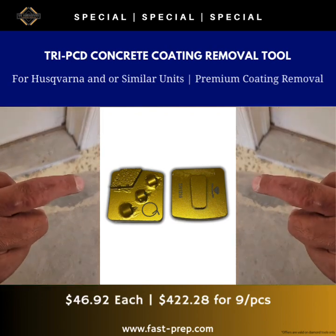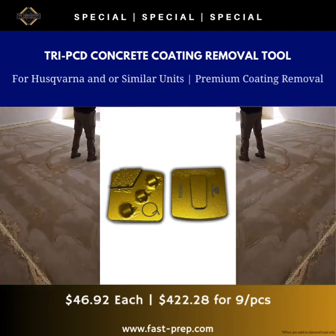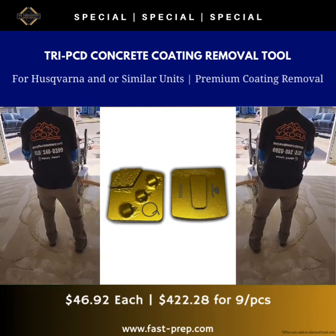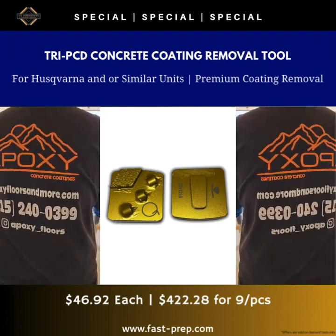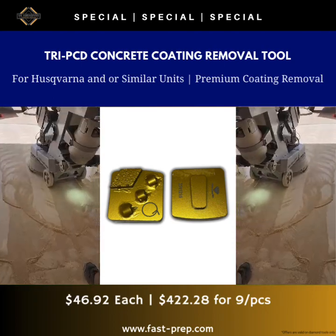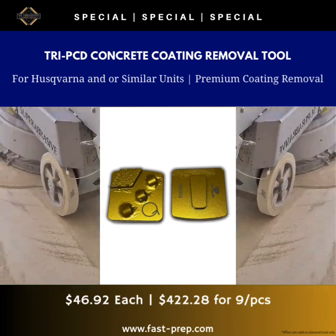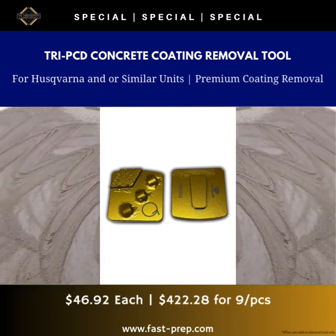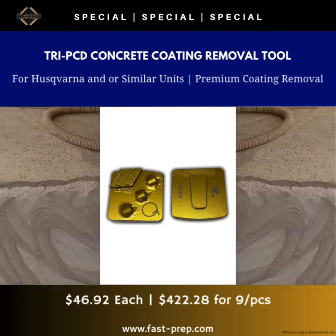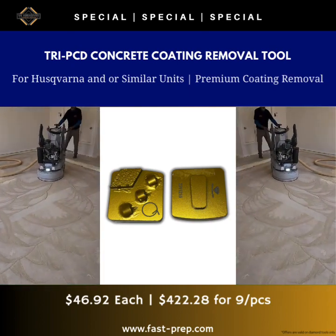You're going to be able to do a heavy removal of protective coatings very fast — from glues, mastic, underlayments, and polyaspartics. You can remove anything that's sticky and it won't smear the coating at all. PCD stands for polycrystalline diamond, and our three quarter-round PCDs have a very thick wafer segment of PCD. It has a very good wear rate, and its cost per square foot is probably around three to five cents, but it is definitely efficient — it will make your machine do a ton of removal per hour. For more information, message me now.